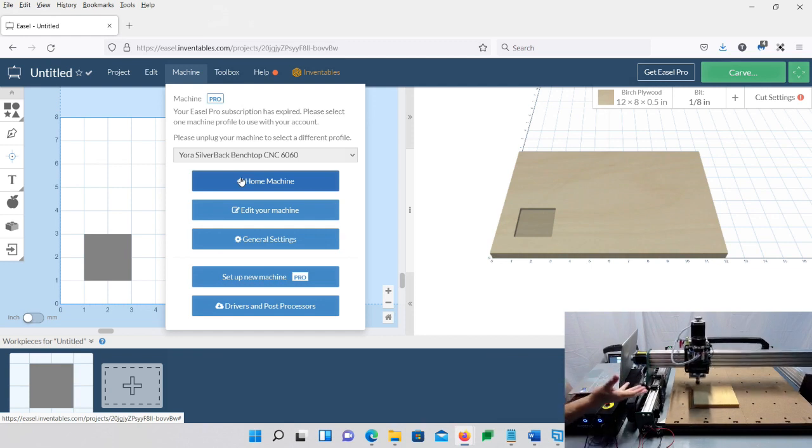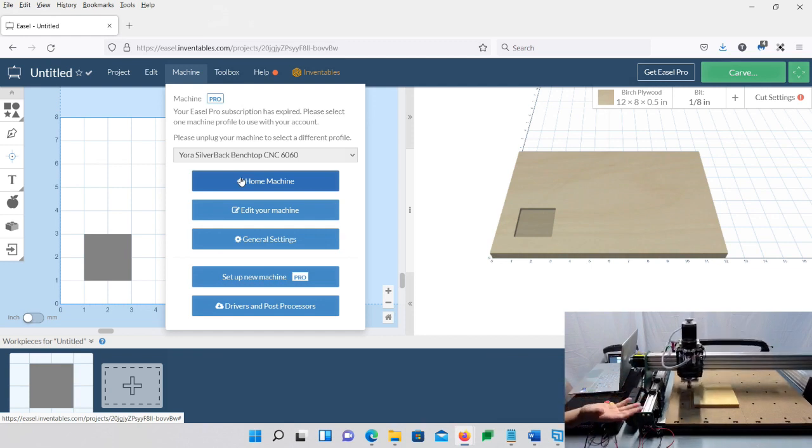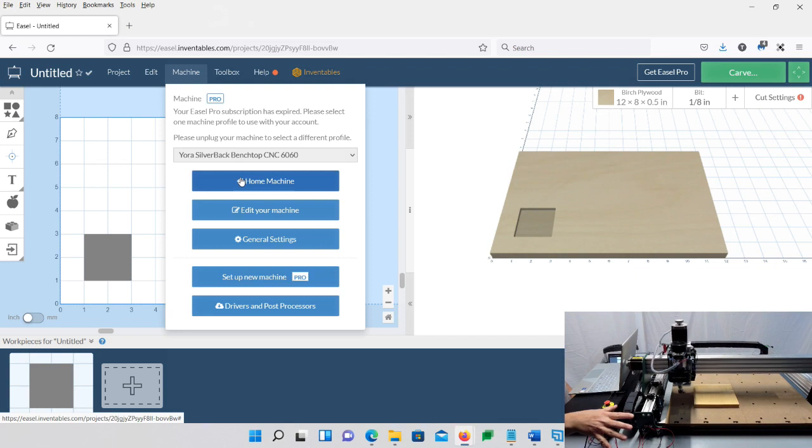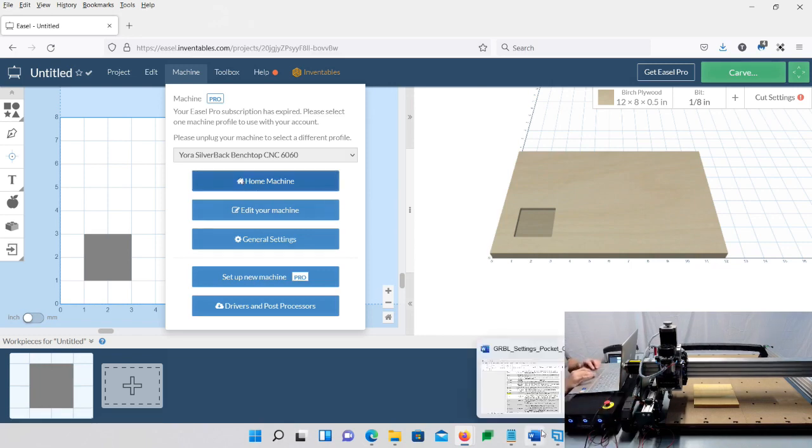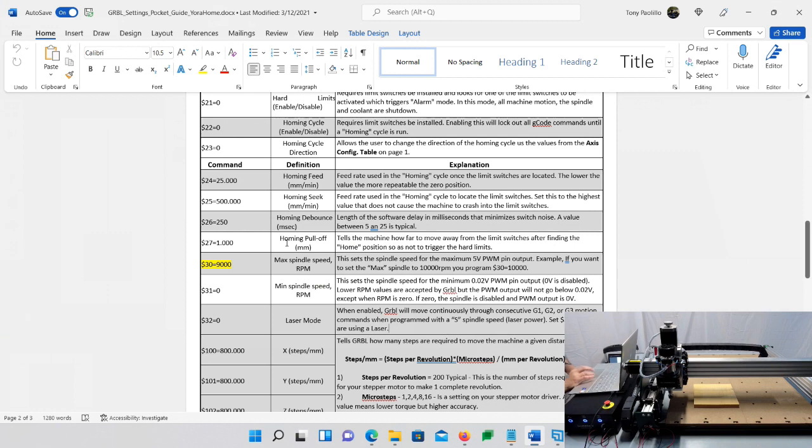So as you can see, it's coming a little bit quicker, maybe twice. It is twice the speed. It's not fast, but it's not slow. And now, see, this is the feed part here, and that is setting number 24. So we changed 25 from 500 to 1,000, so it just moves a little faster, no big deal. And we're going to change 24 to 150. Right now the default's 25, and we're just going to make it a little bit quicker.